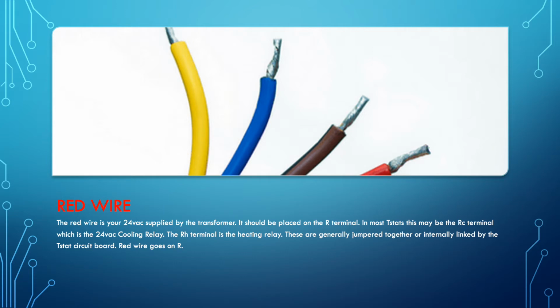Red wire is your 24 volts, generally coming from the transformer, and it will always be placed on the R terminal. Now that could be RC, which is your cooling relay, or RH for your heating relay. It's very uncommon for us to put it on the RH unless you are in fact putting in only a gas furnace with a very dumbed down thermostat. For the most part, whether or not it's going to use the cooling or heating relay is dictated by the programming of the thermostat. For the most part, you're also going to find that they are jumpered together, so it's the same power coming in. Red goes on the R terminal.